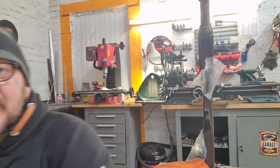The reason I'm making this protector is not because I want a protector. It's because I want to make a drawbar, call it a chuck type affair. I bought a 5C collet holder. I've got used 5C collets in the milling machine, there's that lot over my shoulder in the mini mill, and I want to use them in that lathe. So I bought an MT3 collet holder, and I want to secure it with a drawbar that I'll make and do a video of, but I need to protect the threads. Anyway, I've digressed. Please endeavour to join me.